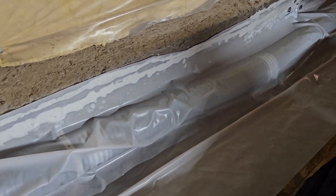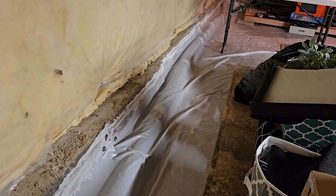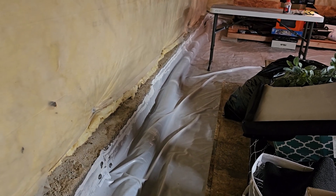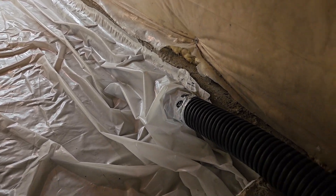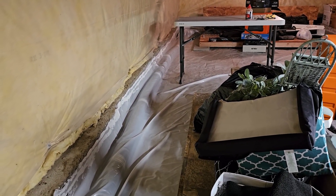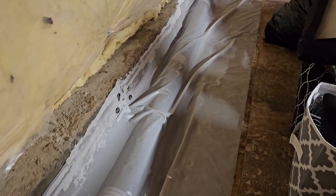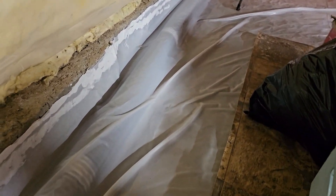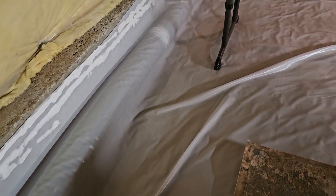This tubing is corrugated solid pipe — it doesn't have holes in it. A lot of people buy ones that already have holes, but what I've learned is that too many holes means there won't be enough pressure or suction to get all the gas out, especially at the end of the pipe. Speaking with people in Utah who install these systems, they said to get solid pipe and put a hole every three feet to make sure you have enough suction to reach the back. This worked out really well. I ended up painting every hole I drilled so that on the outside I knew where they were.